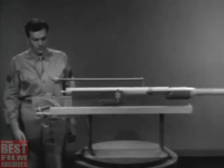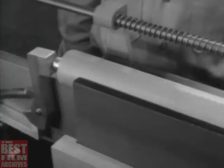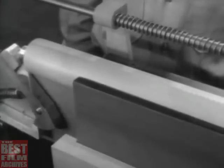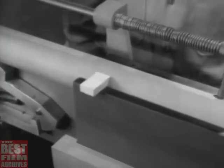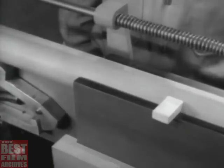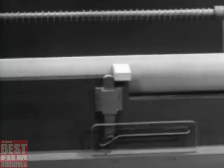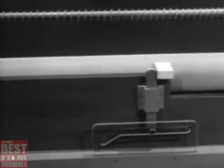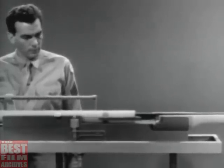Let's watch the action again. As the bullet moves out of the barrel, recoil begins. It drives the barrel and barrel extension back, and the bolt is unlocked. When the barrel extension is stopped, the bolt continues back. When the bolt is fully opened, the return spring takes over. It first pushes the bolt closed. Then the catch slides up the slot and locks the bolt. The return spring continues pushing until the barrel and barrel extension have reached the forward position.